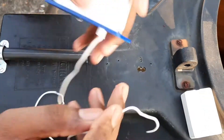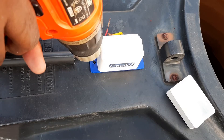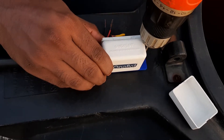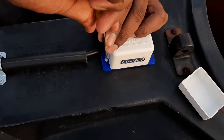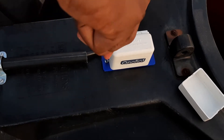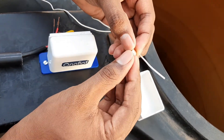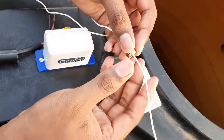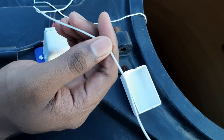Now I am inserting the wire inside that hole into the tank — as you can see that extension goes in the tank. Now I have to make two holes on both sides to fix the float unit. Using a screwdriver and the provided screws I am fixing it in place. We then have to pass the stopper nut through the string by unscrewing the small bolt and passing the string through it. The stopper nut has to be fixed at the maximum level, one or two inches below the overflow limit. Make sure not to over-tighten the stopper nut to avoid breakage of the wire.